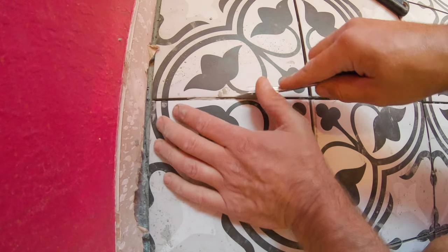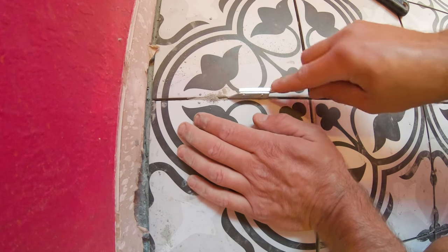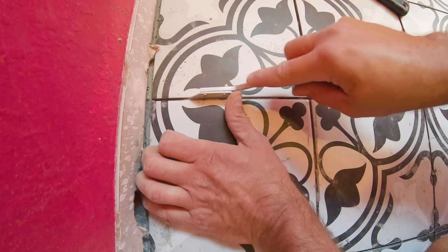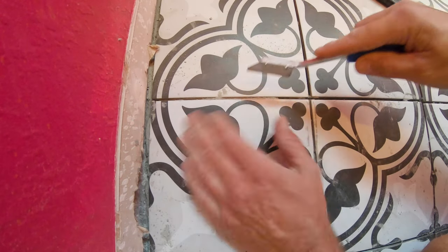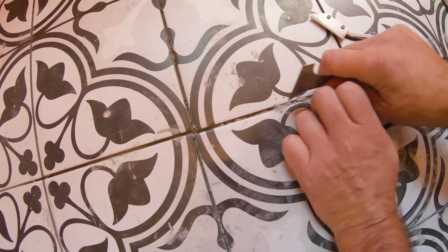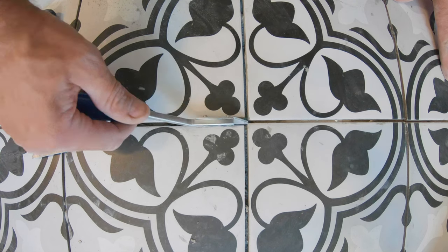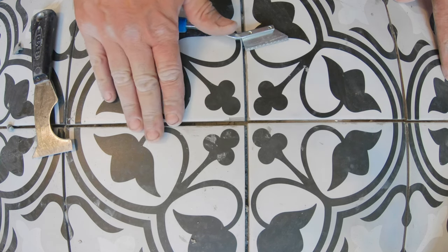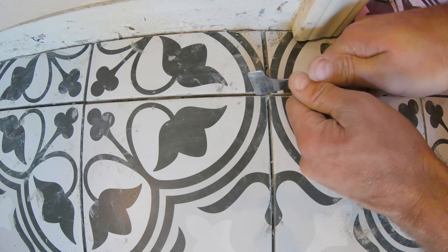A lot of this is just on the outside — the enamel on the tile is going to clean right off. This little tool has a diamond shredder on the side. Just go lightly back and forth — you don't have to go all the way down to the ground, just to the point where you're happy with the grout line. Case in point: I did get a little chip right here from a corner turn and it popped that corner right off. But it doesn't look too big — I think the grout will blend it in nicely. I'll keep it up high enough to where it doesn't matter. In a corner like this, the 5-in-1 works pretty well — push down and it'll powder out.